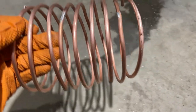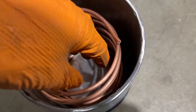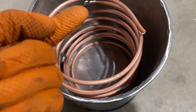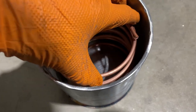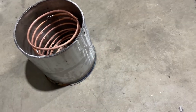All the welds are done, so let's pop a little container together. I just made this coil — what's going to happen is from the cooler the water's going to go in here, around the coil which will be sat in the water to cool it down, and then a little pump in the middle will pump the cool water back out to the other connection on the cooler. That's basically how it's going to work.